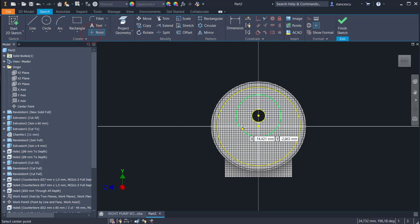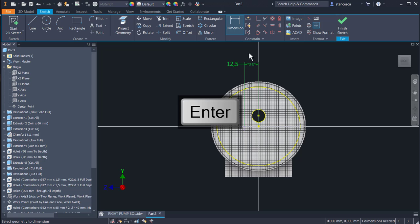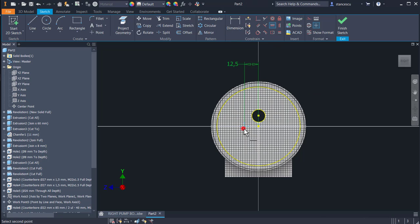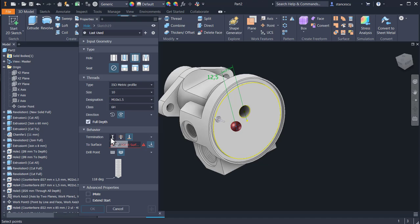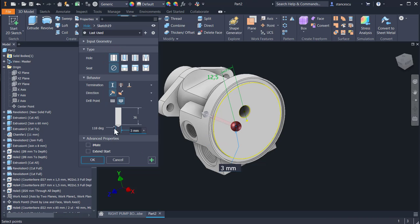We place a point at 12.5, and on the same horizontal, which is horizontal, this, on the same horizontal with a center point. Yes? Finish sketch, hole with termination, depth is 36 and diameter is not threaded, diameter is 5. Okay,